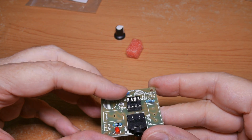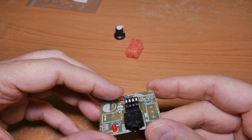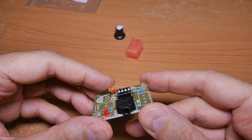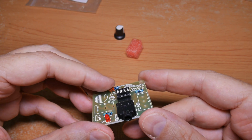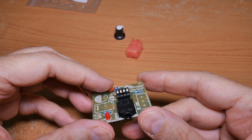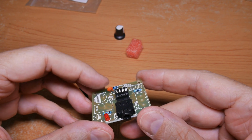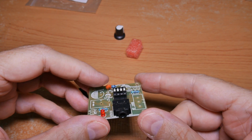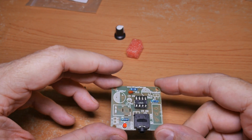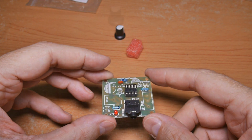Next I'll do these little capacitors. If the wire spacing isn't correct, don't ram them down in there. Use your tweezers or what have you to make some nice bends so they're symmetrical. Also, if the capacitor has a polarization, watch that. Of course these don't, so I will face the writing the same direction on both of them. Those are the little artistic touches for these type of capacitors.